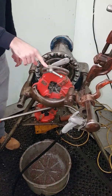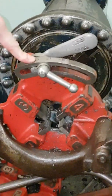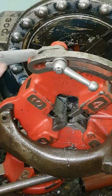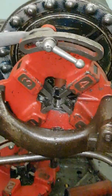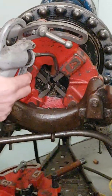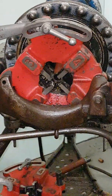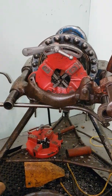You check the top and make sure it's the right size. This is a half-inch pipe and I'm set for half-inch on the top. I put that down, line it up ready to go, and I'm going to need some oil to lubricate. You can't put enough oil on — if I keep squirting it, all that happens is it will go on, go into the bucket and recirculate. So you cannot put too much on, but you can put not enough.